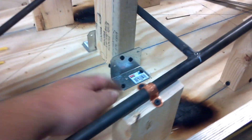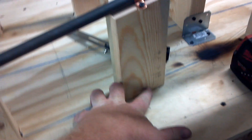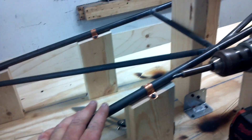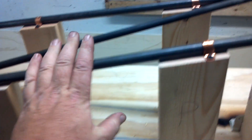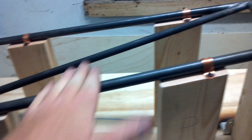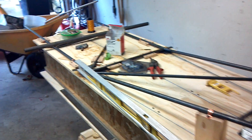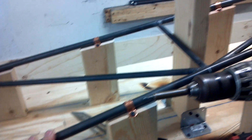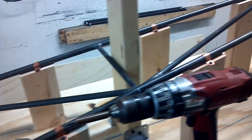I ended up using some brackets down here just to make it a little stiffer. The things on the side I just toenailed with screws. But this assembly is so strong it absolutely will not move — it is absolutely solid. One of the reasons why there's no movement side to side is because the front of the fuselage is locked in. This is a truss structure, so side to side it just will not move. That's the beauty of building a truss.